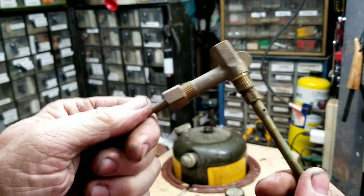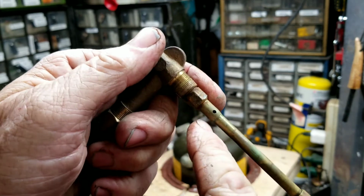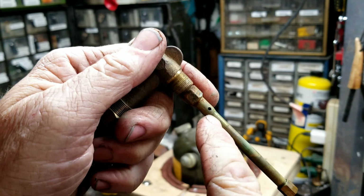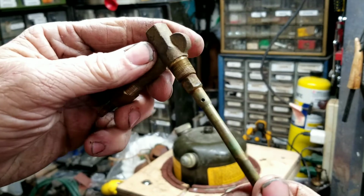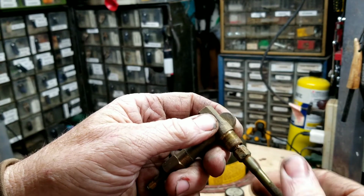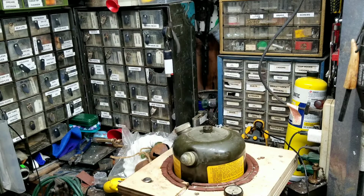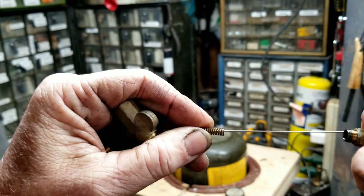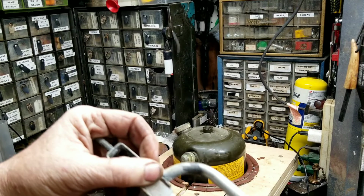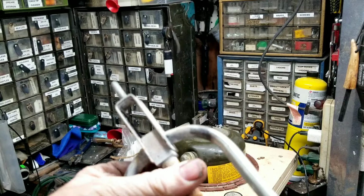And once it warms up, you open the valve all the way and it will push that rod back down and seal off that end, and it will start sucking a little bit of fuel through there, and then the proper amount of air, more air going through there. Stretch just a little life back in the spring. We'll get that in there, so it'll turn out by hand.